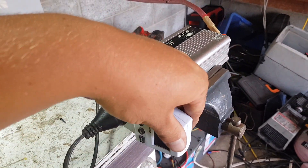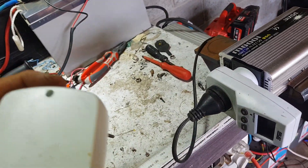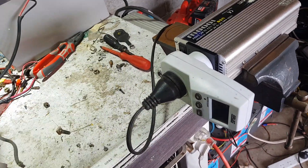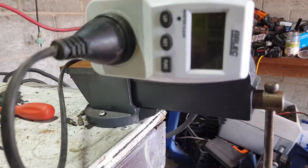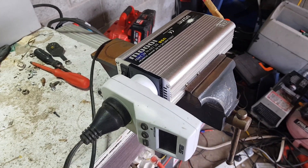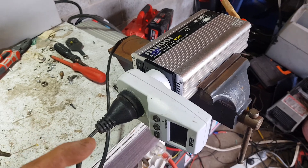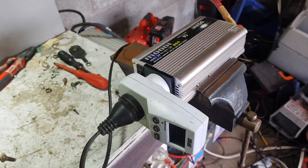We've got the kilowatt meter in the front. Hopefully it's not like some of my other ones which have actually melted the kilowatt hour meters - that kilowatt hour meter in the front of one of my thousand watt inverters got that hot I could hardly touch it anymore. So we'll keep charging Milwaukee batteries and see how much power we can pull out of this off-grid system. 365 watts at the moment, and go for gold. Remember, the ratings aren't always what they seem to be, so don't get hung up on what you see - get hung up on what you see tested.